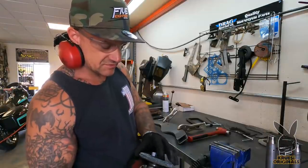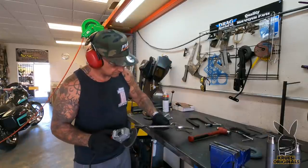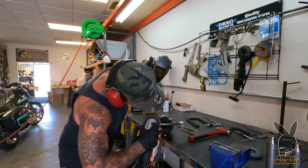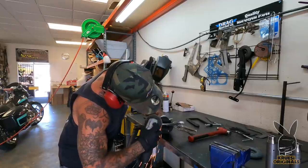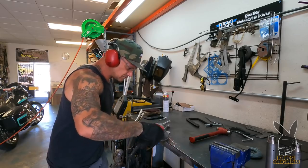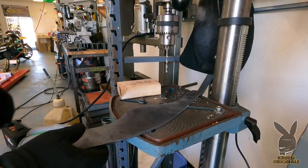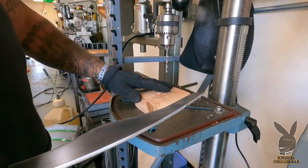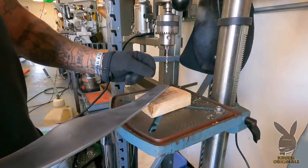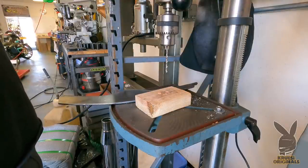Got a brand new disc — good for doing flat straight spots. When I'm drilling through steel like this I like to put a piece of wood underneath so I can punch through good and hard. Always start out small — pilot hole, go up a little bit, a little bit, a little bit. You don't want to try and drill a half inch hole all at once; it'll take four days and ten drill bits.